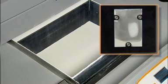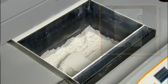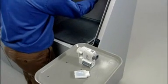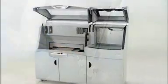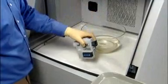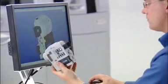When printing is complete, a vacuum and motion system automatically removes up to 80% of loose powder and recycles it for future use. Removing the remaining powder is just as easy, using lightly compressed air in an enclosed chamber that vacuums away particles as you go. Every 3D model emerges clean and ready for finishing. The ZPrinter 650 comes with a convenient built-in finishing station for an integrated, all-in-one 3D printing system. Simply dip your part in Z-Bond sealant followed by a short drying period, and you get a smooth, vivid color model that lasts — and you get it fast.